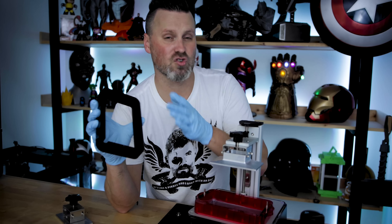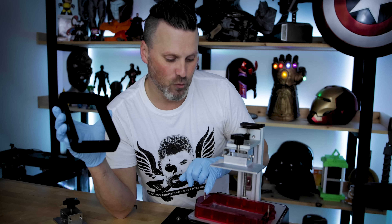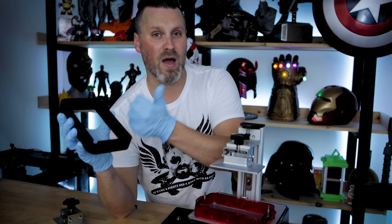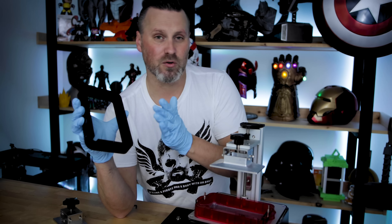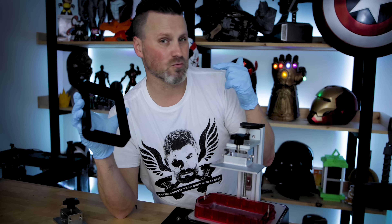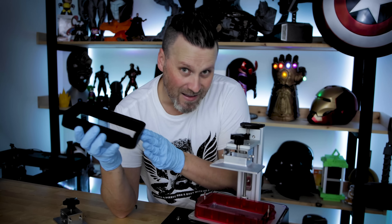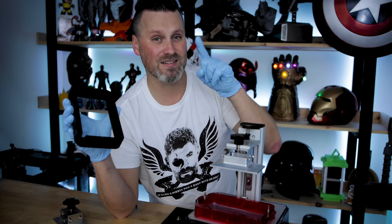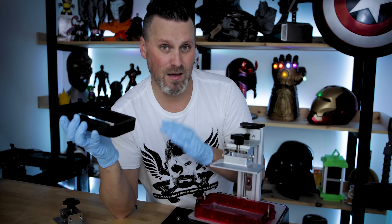The other reason I bought this, other than just to show it off to you guys, is that I like having multiple vats for these smaller resin printers like the Sonic Mini and the Elegoo Mars. The reason is I can very easily swap vats in and out. If there's a failed print, I don't have to sit and wait until I've cleaned out the vat, filtered out the resin, and everything before I can get a print running. If I'm running jobs for a project I want to keep printing continuously, so this enables me to have multiple vats and just continue printing. It's super helpful especially if you're running an Etsy business printing miniatures — you really should invest in multiple vats so you have no downtime.